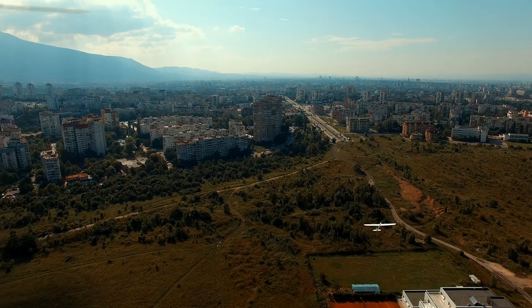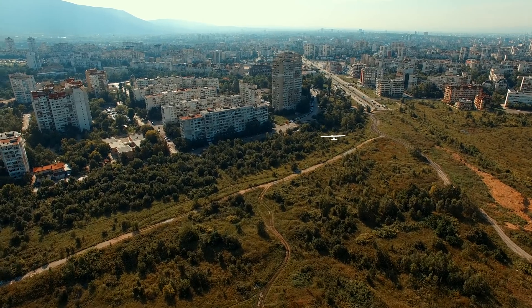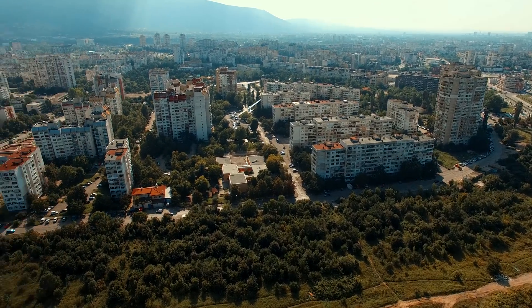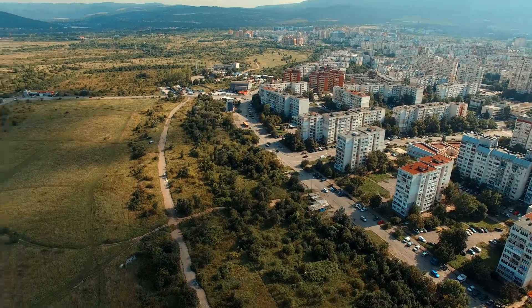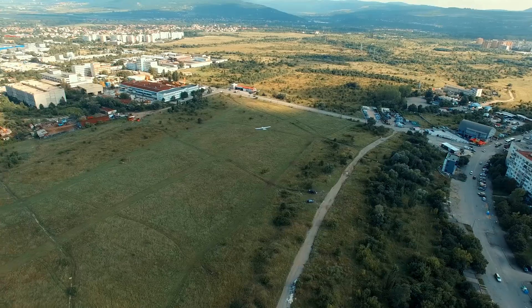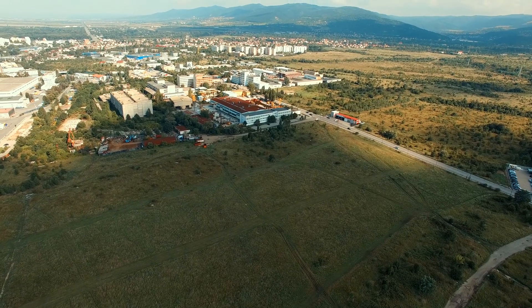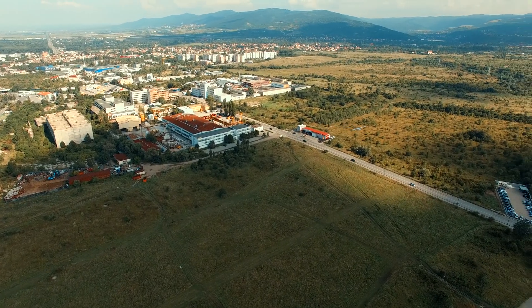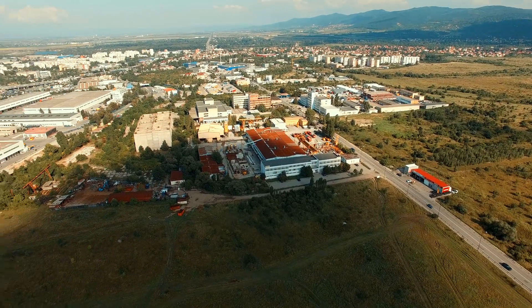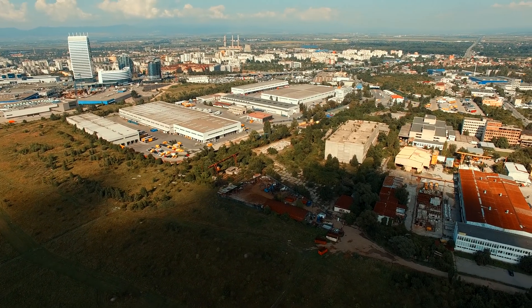Overall, I really didn't know how this Omnibus F4 Pro and ArduPlane marriage was going to perform or what to expect. But at the end of the day I was left with a sense of security, because in this combination I had seen something familiar and reliable in the face of the ArduPilot code. The flight controller seemed to handle the code well, and all of the features, the performance, the dependability I have come to expect out of a Pixhawk — I did see here as well. This new pairing of board and code was working just as well as any Pixhawk I have tried, at least for what I wanted to do, but at a fraction of the cost.